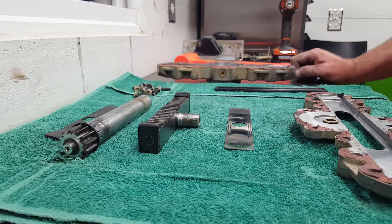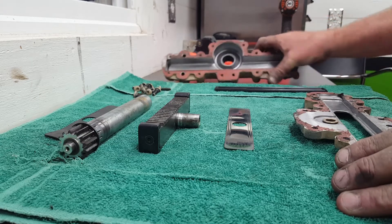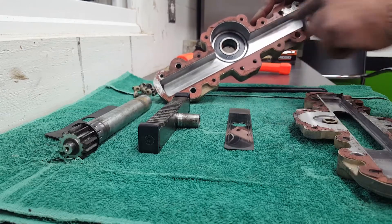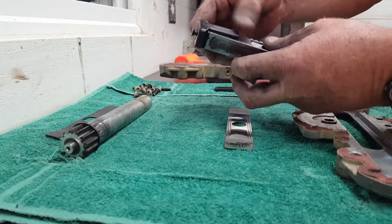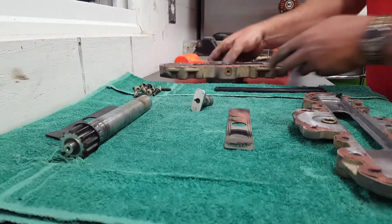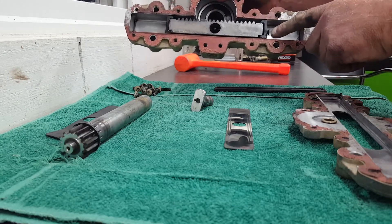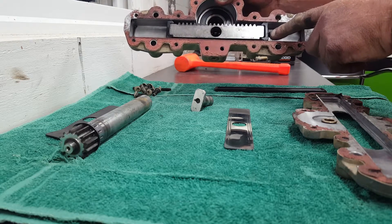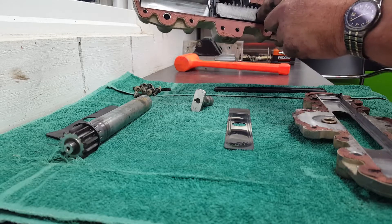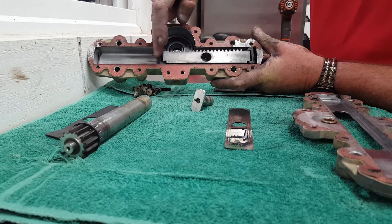We're back — got everything pretty much cleaned up as good as we can. You can see where the bushing was rubbing on the back side of the case. These plastic bushings on the end are what sit in the back and drive the rack, driven by the worm gear. As you can see from when we first broke it open, this screw has backed out, letting that bushing drop down and causing the gearbox to go into a bind. That torque screw hits the end of the gearbox and doesn't let it turn all the way.